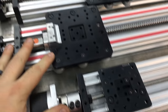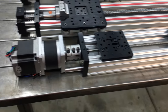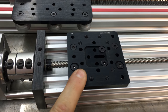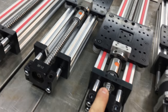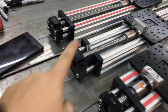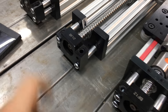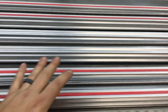Thanks for following the build so far. This is what I've got done: three five-foot-long actuators and the print head actuator. This is a planetary gear reduction — I believe a 10 to 1 — so that should give me very precise movements, a couple of microns per step. The actuators took a while. This is the one I've been showing in the videos, but I just finished these two, and they're basically identical. For this one I cheated a bit — instead of using a graduated drill, I just used an angle grinder and chopped out the slot for it.